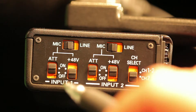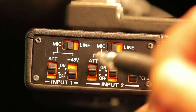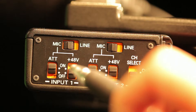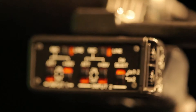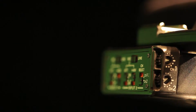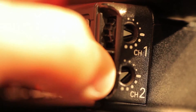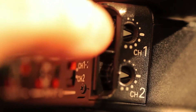If you were to insert the XLR cable for the Sennheiser microphones that you check out in your send kit, the phantom power could be in the off position because Sennheiser mics do not require phantom power. The +48 volts is an electrical charge that goes into the XLR cable to power the microphone. On the side of the adapter, you can see the level settings for channel one and channel two — these are for the microphones going into input one and input two, and you can adjust them appropriately.